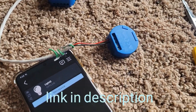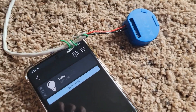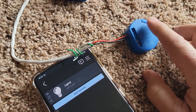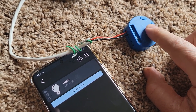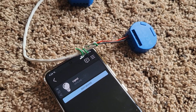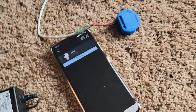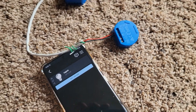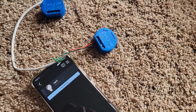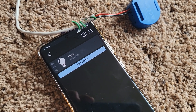Shelly puts out a great little video on how to connect to these things — it's very well done, I recommend watching that one. Initially the Shelly device will put out its own access point. You look for that access point on your phone's Wi-Fi, connect to it, and from that interface you enter your Wi-Fi information. After you've installed the app you connect to it and add the device — though I had a heck of a time adding the device.